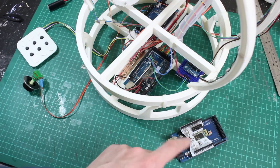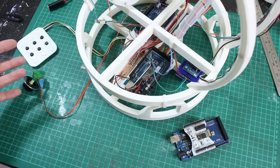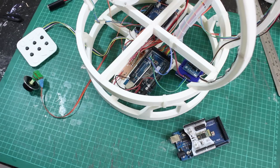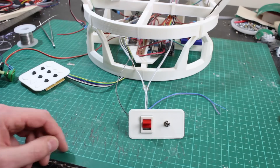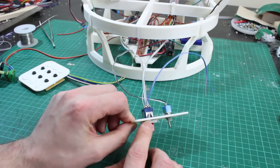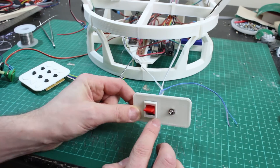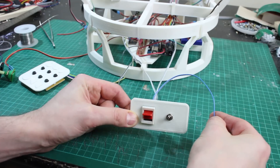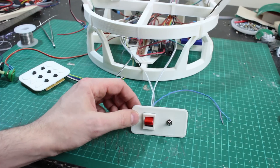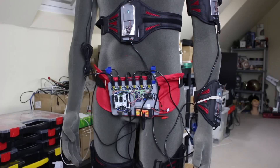I've already used the other serial interfaces — one is for the speech module and one sends and receives to the robot. I'm going to add a switch that takes another pin high or low on the digital IOs so I can put the brain into a different mode when the motion capture is attached. I've installed a toggle switch which takes a pin low so it knows not to listen to emotions anymore and it's in manual mode for puppeteering. There's also another switch that breaks out the two serial lines and gives me another one to go off to the receiving Bluetooth module.